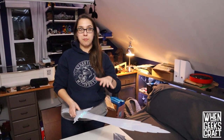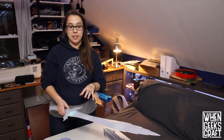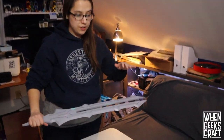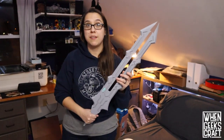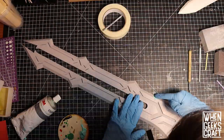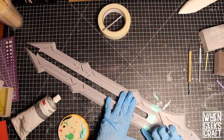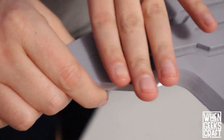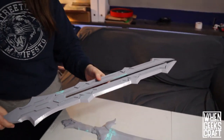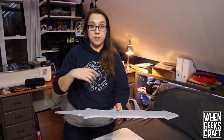In making Chillrend, we learned a lot about model making for molds. So in working on the Thunderblade, I wanted to avoid all the post-process work and just do this right from the get-go. So I spent a lot of extra time making sure all of the sections where the seams met are sanded very well. The top has been spray painted with a clear acrylic spray paint, so it's very shiny and very smooth, as well as lots and lots of layers of filler primer.